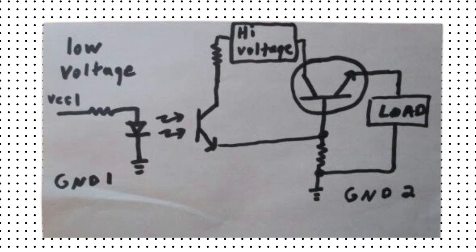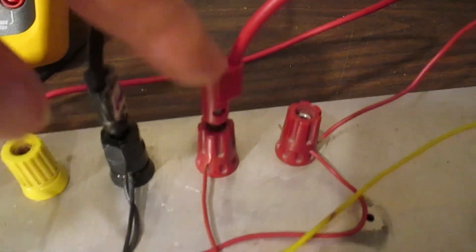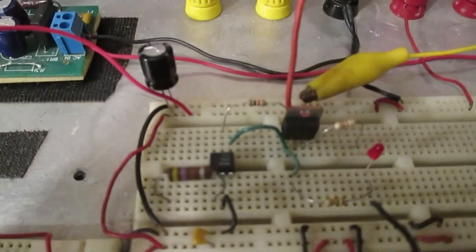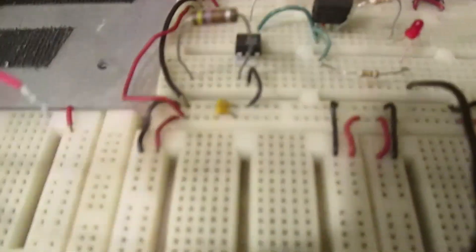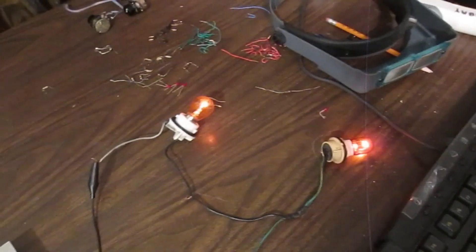Notice that the ground on the low voltage side is a separate ground from the load side. Our circuit is very straightforward. Our opto isolator is energized by a 5-volt supply. When we energize the LED of the opto isolator, going through a bias resistor to limit the current through the LED, we turn on the transistor on the other side. Energizing the opto isolator, the LED lights a little LED here and lights the two 12-volt bulbs.